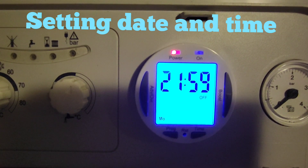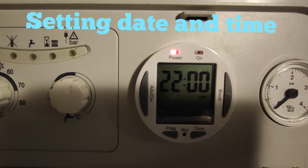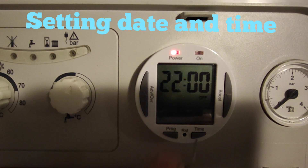I'm going to show you how to use a Ferroli clock — it's an updated one from the version they used for a long time. We're going to start from the very beginning, and I'm going to try to do this in sections: how to set it up, how to set the times to come on and off, and what all the extra buttons actually mean. We're going to start by pressing the reset — press it in and out.